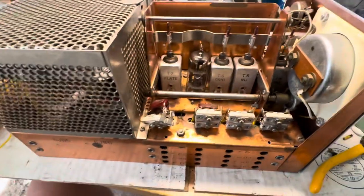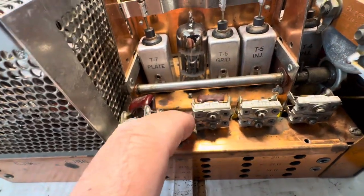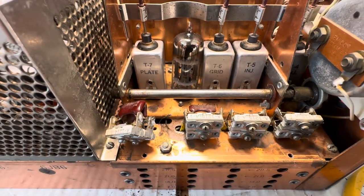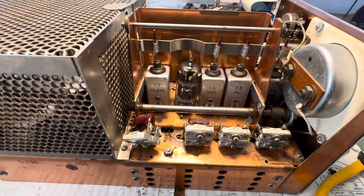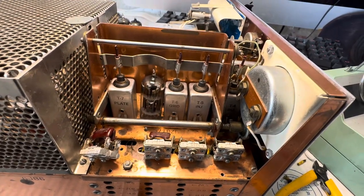Then I'll work on the AM modulator later after replacing that resistor. So I'm just going to put some insulation on here and put that back together, see if the short's gone, then replace the B+ resistor. Then I want to put this mod on for AM.